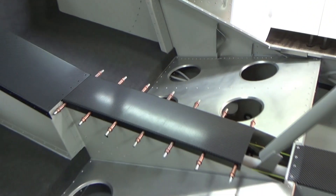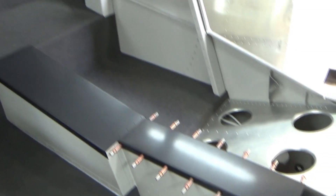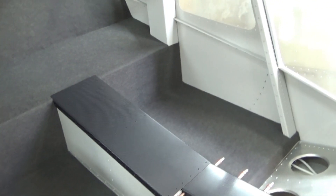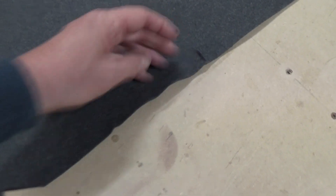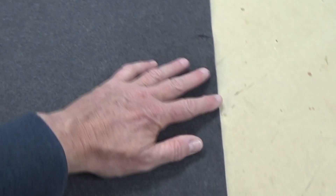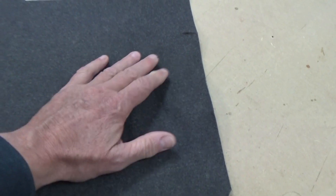There is talk of anchor nuts, but you really don't need everyday access into that centre section once it's serviceable and signed off. Last piece of carpet for now — the seat pan. Just started marking it out. Put a few nicks in for the stringers and the formers. Before you cut, just make sure you flatten it out — the edge can bunch up and then it's not square. If you flatten it back out, gives you the true reading. I've also cut for my conduit on the other side.